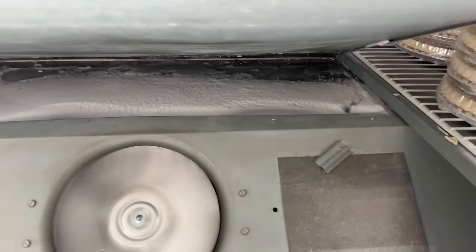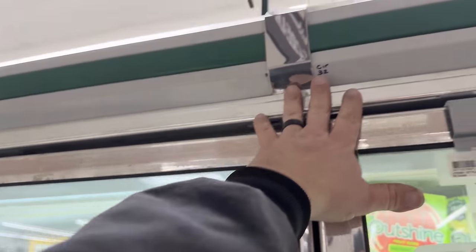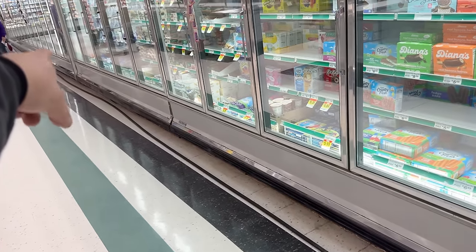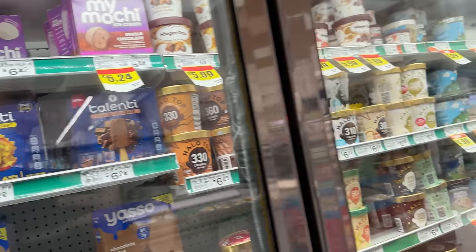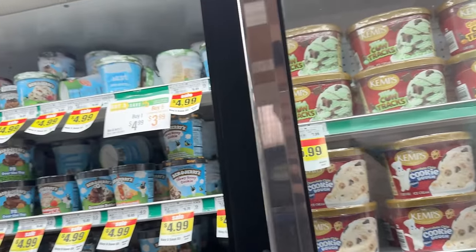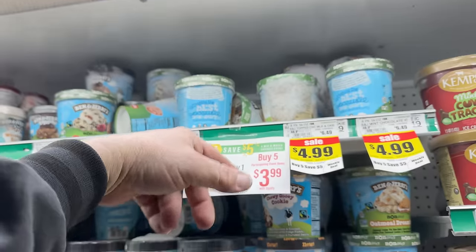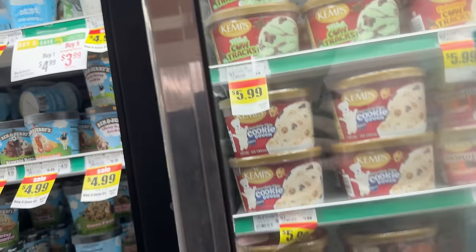Fan's running, coil's froze. Guess what? Pulled the whole case — because that's a flipping mess. Each one of these is a case. So from there to here is one case, from there to that silver thing is another case, and the third one down here is another case — it's got its own evaporator. These all feel like they've got good airflow, so we're not going to mess with these. If they were cut off, they would have poor airflow. They were doing something on the Vance Refrigeration Podcast about these little things — something about them causes it to do that.